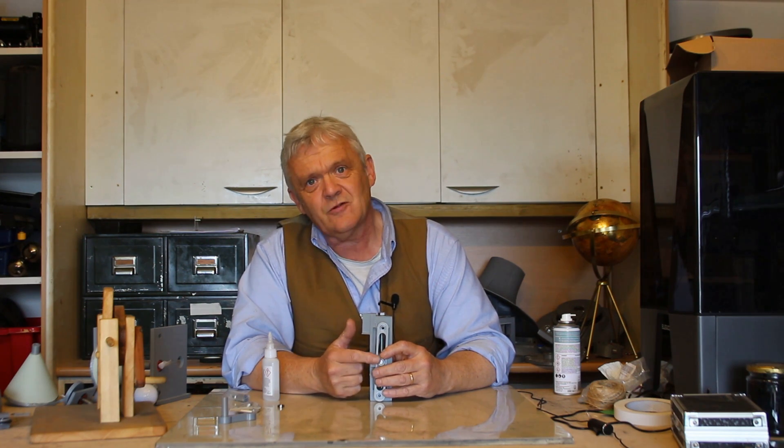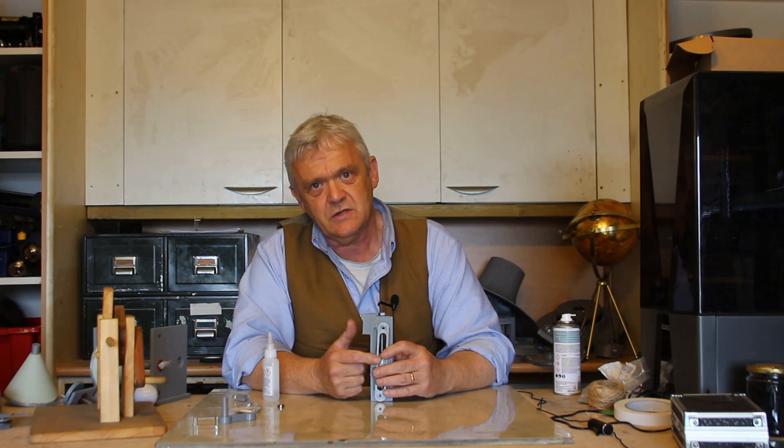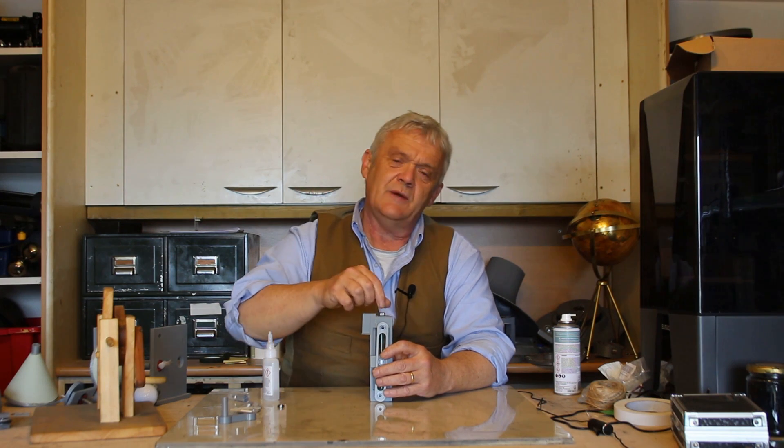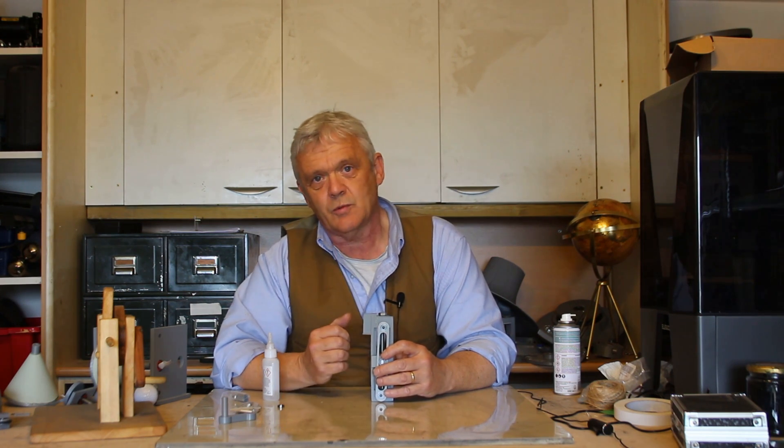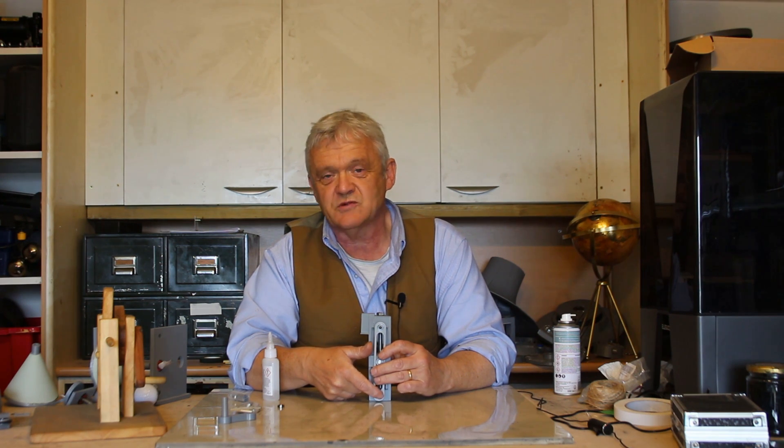With the Evans cone drive, the cones had to rub against each other, but with this design there's very little pressure on the pivot point — it's just a pivot — so we're able to move it up and down much more easily than moving a ball in and out. What we need now is a way of pushing that arm backwards and forwards, and converting that linear motion into circular motion.